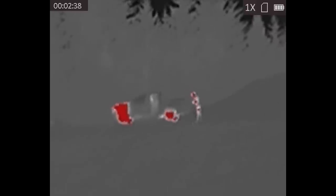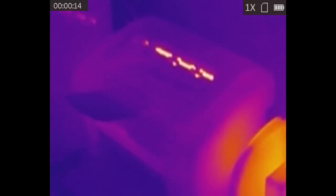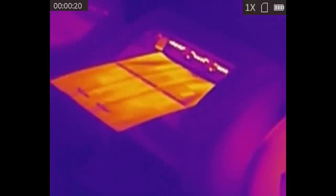There are four different modes on the TM-160. White hot and black hot are the traditional thermal modes you remember from Call of Duty. Red hot is like white hot mode, except the hottest things in the image are additionally colored red. Fusion mode is just colors — I don't find it that useful except as a novelty. Buried in the rather cumbersome menu are a lot of additional features. You can turn on a marking mode that highlights the hottest thing in the image with a green crosshair. You can also switch between jungle mode and detection mode, though I didn't find them to make much of a difference on this device. Images and video generated by the camera have a 720 by 576 resolution, the same as the viewfinder.